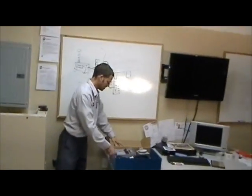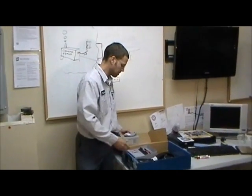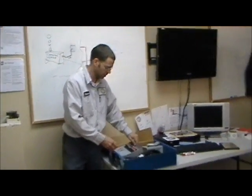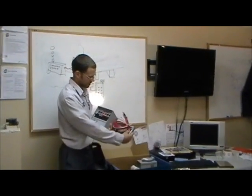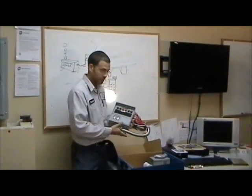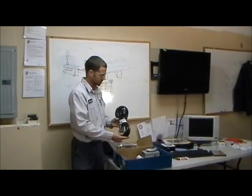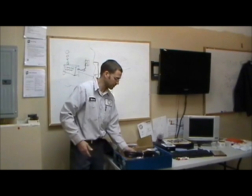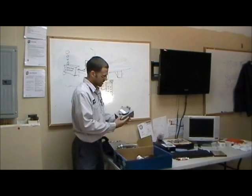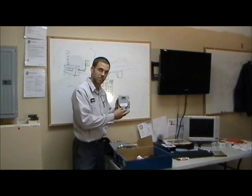You have a series of equipment, starting with the power transfer — the actual unit that switches power off from the panel. There's a simple patch cord that goes and attaches to the generator, powers up from the generator, powers up the panel in the house through the transfer switch. The means of powering up the transfer switch is this receptacle.